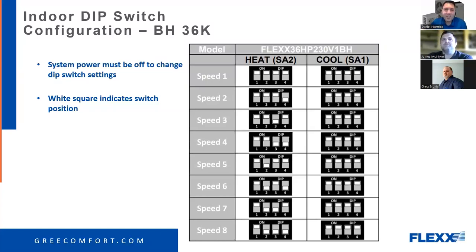John Culler asks: B must be connected at the air handler terminal and then to the outdoor unit — what if it's wire-nutted inside the air handler? Then the air handler won't know it's in heat mode, and the D defrost function won't work. The D signal from the outdoor unit will mean nothing to the indoor if B is not connected. I tested this myself — when I didn't have it hooked up, the D signal had no effect on the blower.